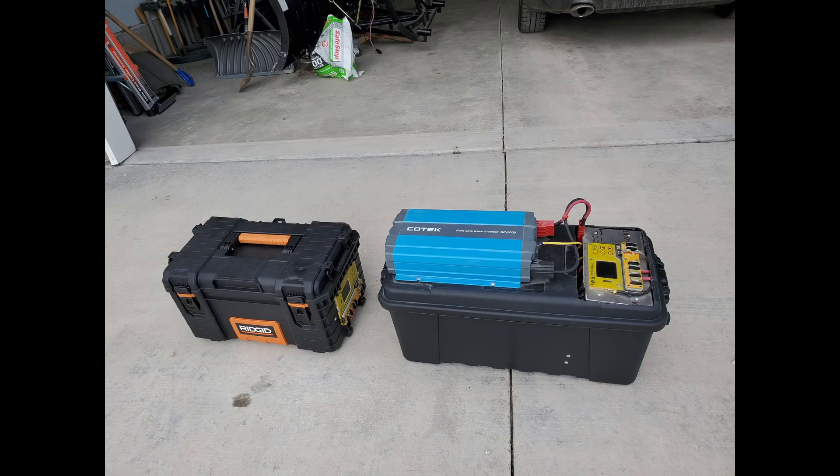I don't like the NMC type of battery in the Yeti. I understand why they use them — the batteries cost less and are lighter than an LFP battery. They aren't concerned about getting 10 to 20 years of daily cycling like you can with the LFP battery. They just want to make sure they will last until their warranty expires. Then the user will have to go back to them to get the battery replaced. It's a win-win for the company — they make a profit when you buy the system, make even more money when you come back to replace the battery, and even a second battery replacement. All the while, a system with an LFP battery will still be on its original.